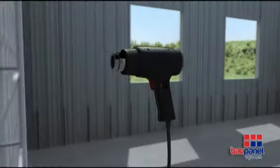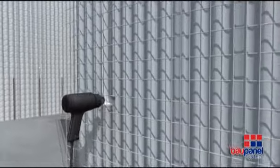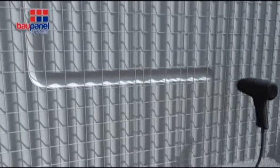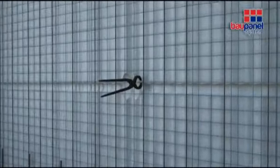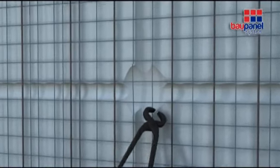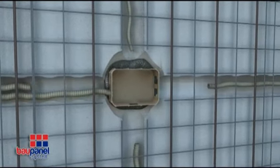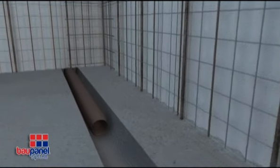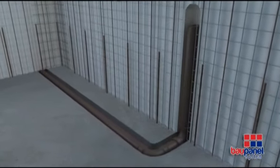Wiring and piping for utilities are added quickly and easily by installing conduits or cutting channels using hot air, which depresses the expanded polystyrene from the core of the panel without creating any residue. This optimizes the speed of the installation. Inserting electrical or telecommunications branch boxes is a very simple operation and can be fixed to the panels without any problem. In order to insert elements of larger installations, you can cut out sections of meshed areas from the panels, which can be replaced afterwards with flat reinforced mesh.